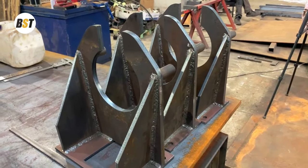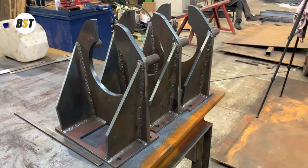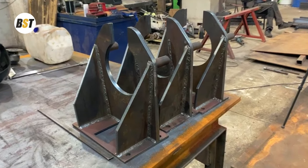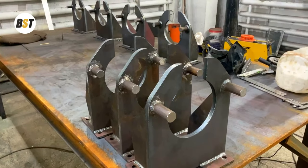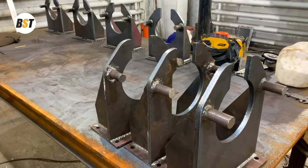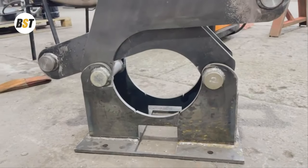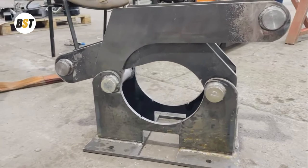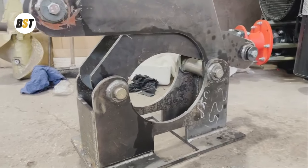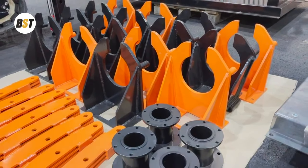The professional drilling table with a centering ring is needed for faster fixing and holding of drilling rods or other tools when building a drill string, and to avoid tilting the drill string from center. Special tools can be added: a pipe grip and a pipe setter, which are used to facilitate the task of securing a pipe in place and pushing it down. The drilling table can be made removable by your request in case you need to drill with augers of larger diameter, like 350 millimeters.